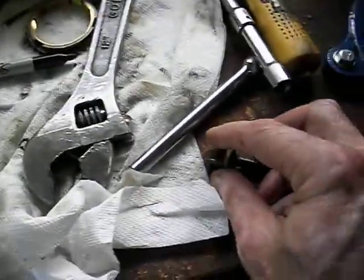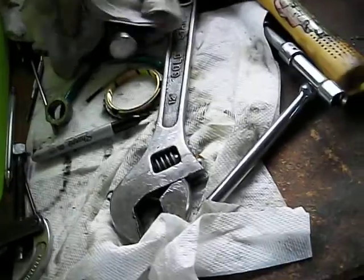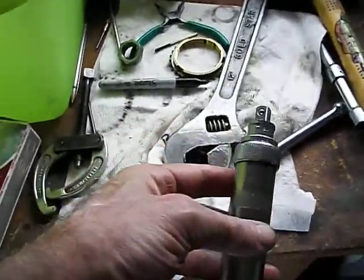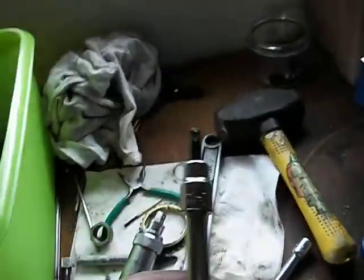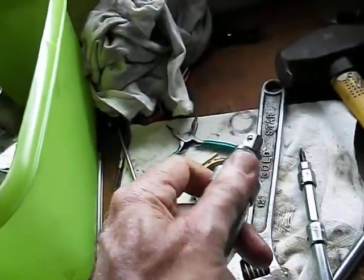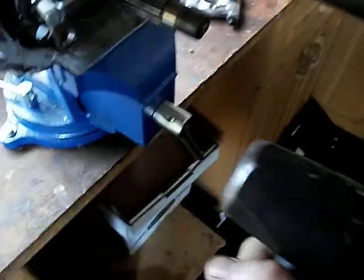Your best friend when it comes to doing this kind of stuff — forget any regular hand tool. What you really need is this guy right here. This is a handheld impact driver. I've got a much better Craftsman but it's a half-inch drive and I couldn't find a Torx bit that used a half inch. Basically, you put this onto the impact driver. You spin it one way to tighten and one way to loosen. I repositioned the bearing plate so it was always down close to the vise — I don't want to be banging up high and getting movement from the plate. And you basically just go to town on it.